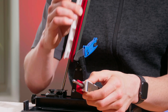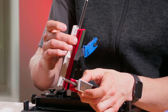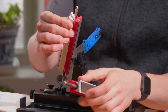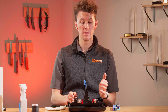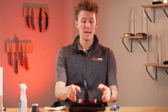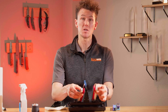If you use the standard down and forward sharpening motion, you will slice open the lapping film and render it unusable. It is really important that you grab up at the top to prevent any scratching on the actual body of your blade, so make sure that you're holding up at the top. I want to be pressing into my blade just enough to make sure that the rubber is deforming a little bit along the edge — this is what's going to actually create the convexing. I'd compare the pressure to how hard I press when I strop, a little bit harder than when I normally sharpen with diamond stones. Also think about whether you're putting equal pressure in with both hands. If you're using more pressure on one side, it will become apparent. I have a dominant hand, so I pay a little extra attention to putting enough pressure on with my non-dominant hand to match that dominant hand so I don't get uneven bevels.